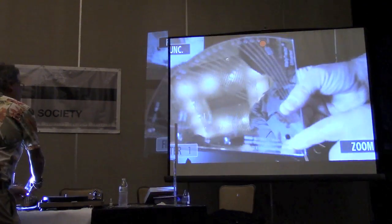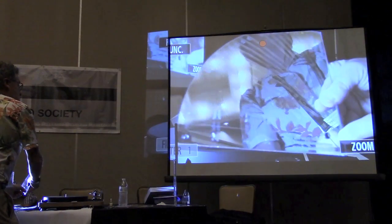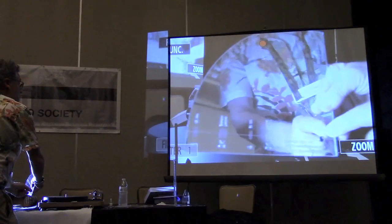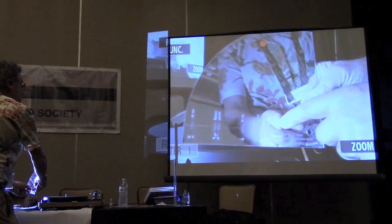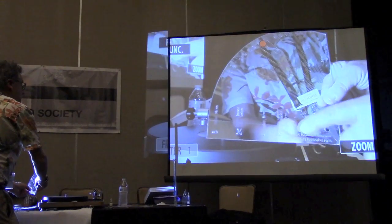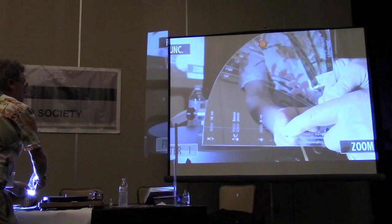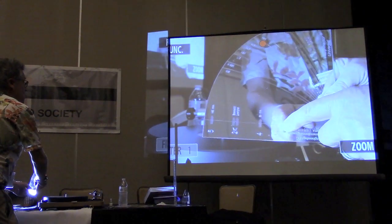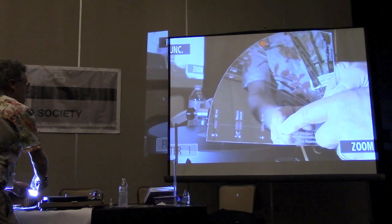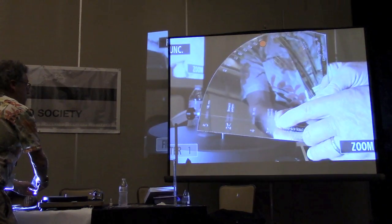So here's a straight line going from the spindle to the outer edge of the record. So that's the way the record was cut. And you'll see there are two sets of hash marks, one here and one here. Those are the two null points that we've been talking about. So the next part of this process is to put the stylus tip in the null point on the line in the center of the three hash marks.